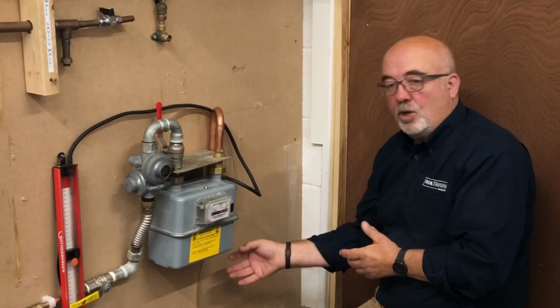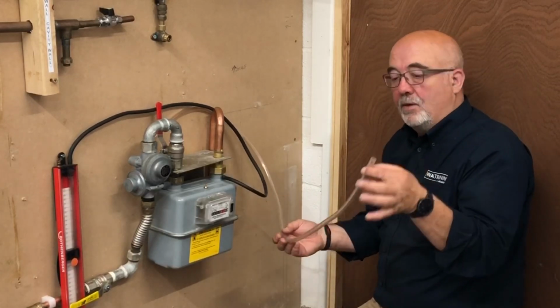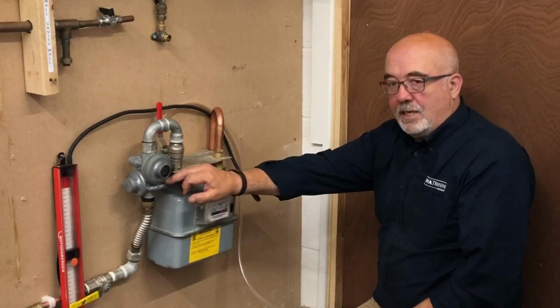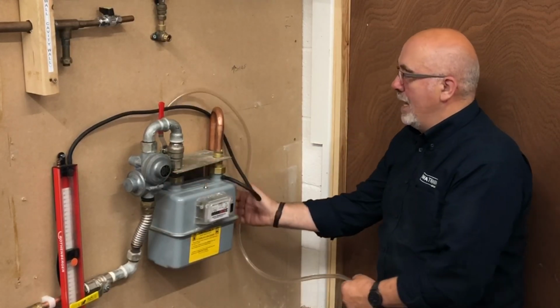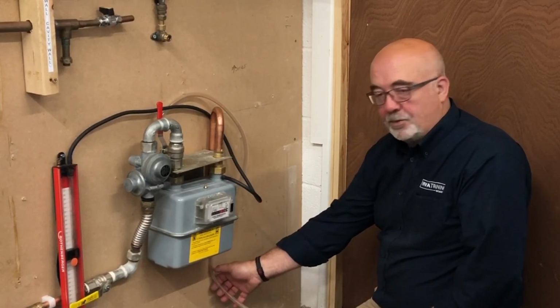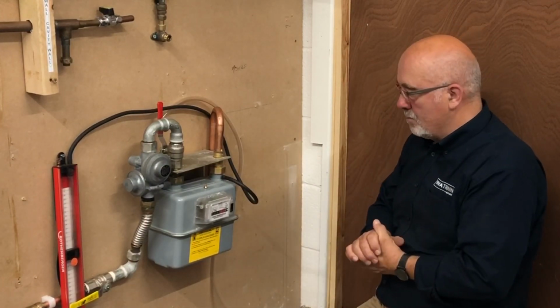It must always come out of the box and then go through into the property, including, you'll come across this and people ask quite often, what is that rubber tube for? Because we're dealing with high pressure, it does have a built-in overpressure release valve, and that again will be fastened inside the box, and it must come out no less than 25 millimetres out the bottom of the box, purely and simply so it can't just fill up inside the box.